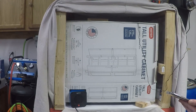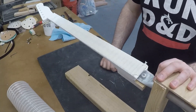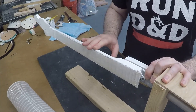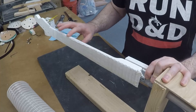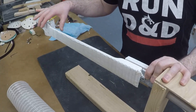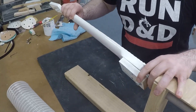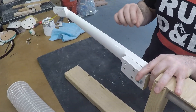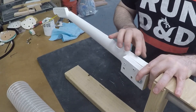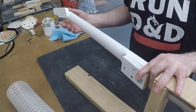My two-part automotive clear coat oven. I want to remove this masking and remask the fretboard. The reason I want to do that is this has had layer after layer of stuff put on it, sanded off, put back on over and over again. I'm concerned about this line here — I'm concerned about tear out, I'm concerned about it being too much of a ridge. I want to remask it just ever so slightly higher so that the last two layers of clear actually go on over the line of where the paint is, coming over the top of it.